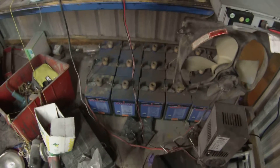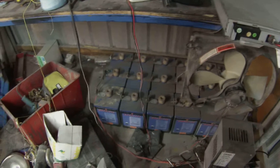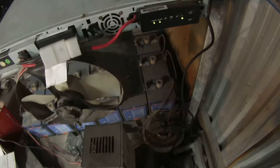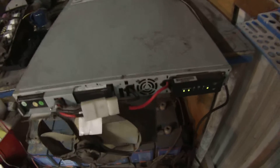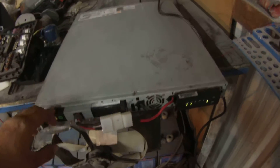So the next couple of days I'm going to probably use the vacuum cleaner with a soft brush to clean the top of them off, providing the voltage of this is alright. I've got a solar panel infeed there that goes to these and keeps them charged - it's unregulated but it's only a 40 watt panel, and these are 660 amp hour at 12 volts. So yeah, this UPS should be good for backup power. Failing that I do have an HP one over there, but we'll roll with this one for now. I'll let it charge up and sit the multimeter on it a bit later and see what kind of voltage they're up to. Thanks for watching.